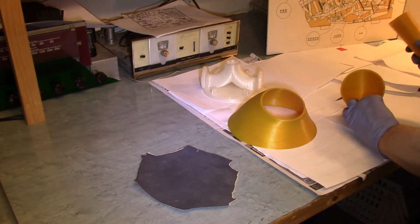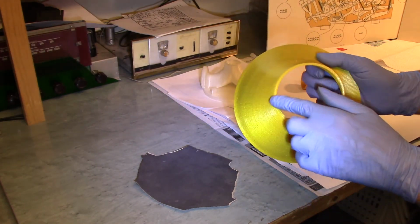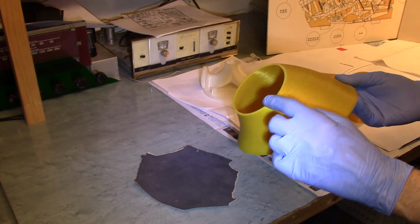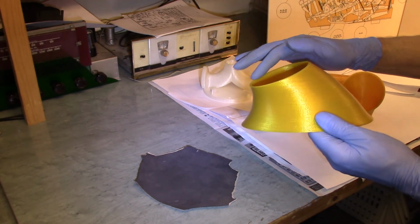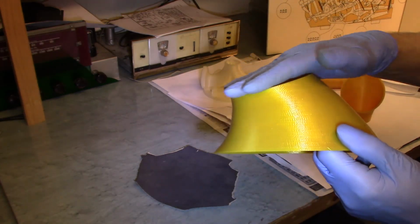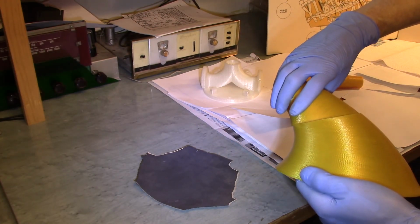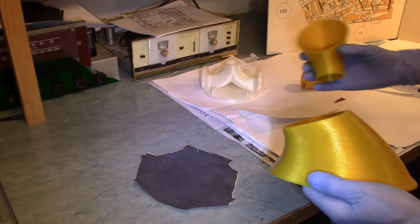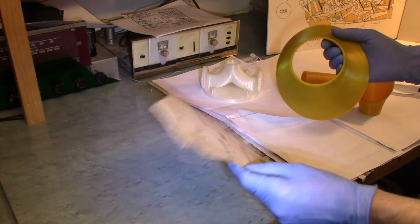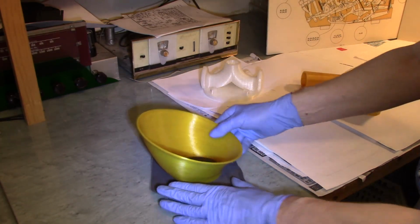And the biggest thing there is making certain that all those surfaces are flush and true, as flat as possible. When this is 3D printing, it's doing multiple layers, and this particular print came out very fine because I had it set to a very fine level, but you can still see if you look very carefully that there are little fine steps involved. So that plane wouldn't be quite as flush and smooth as I would like to glue up against this guy. So I want the glue bonding to be as tight as possible. The idea here is I got some fairly fine sandpaper, 320 grit is probably good enough, and I'm just going to very lightly go on a flat surface here. This is a fairly flat surface.